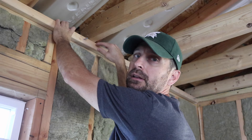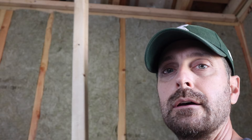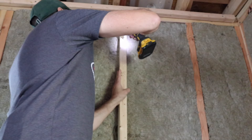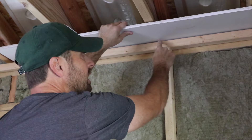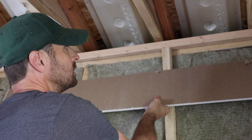If you have it at half an inch, that's way too tight — three quarters of an inch is perfect. The next step is to take your other two-by-two and screw it to a stud directly beneath that top two-by-two. Without this lower piece, when you're lifting up a full eight-foot sheet of drywall by yourself, you'd have to get it over the top of that lip. This lower piece provides a guide so you can push the sheet up the wall and just hook it into place. Super simple.